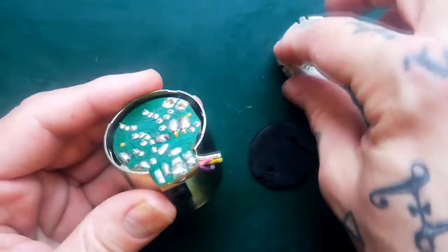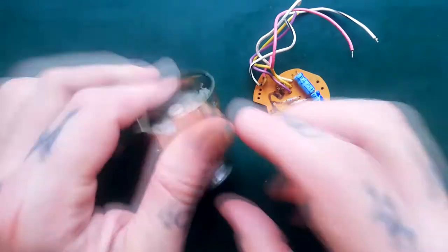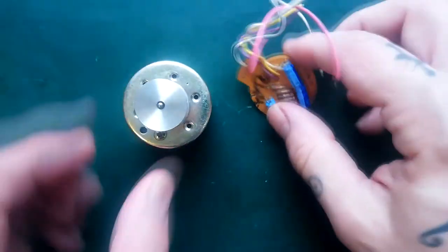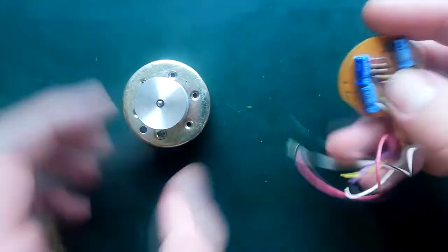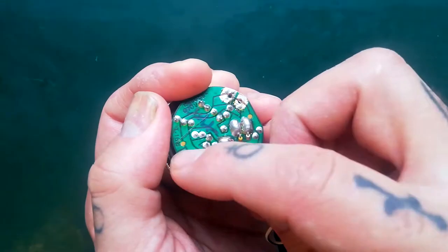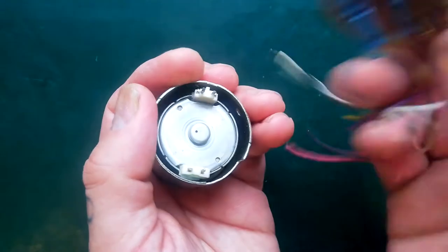This one's still soldered in. And here's one - I think that's a 244, yep, this is the 244 servo. So if you de-solder two pairs of pads here then you can remove that.